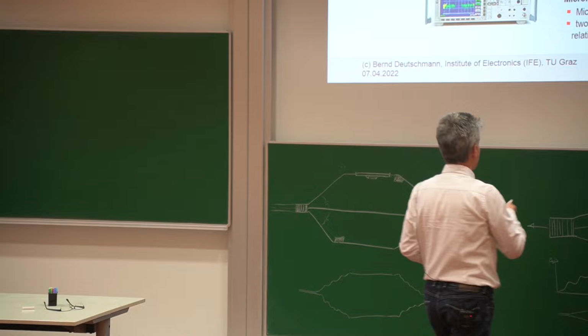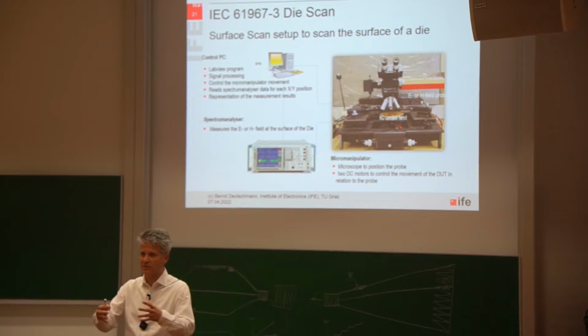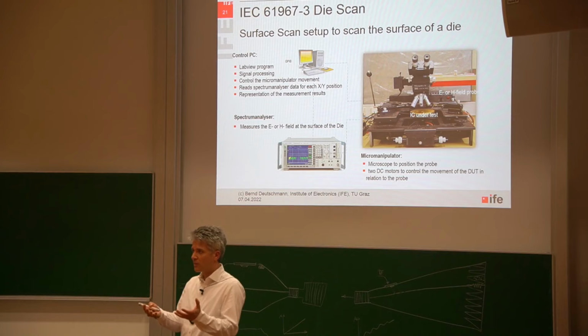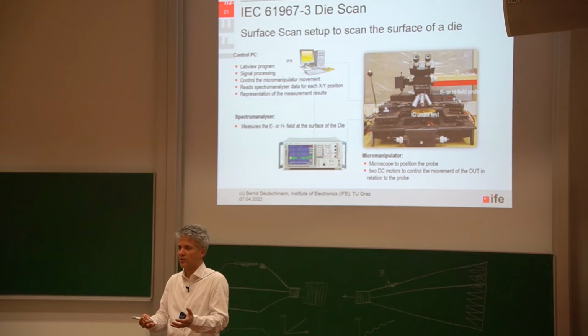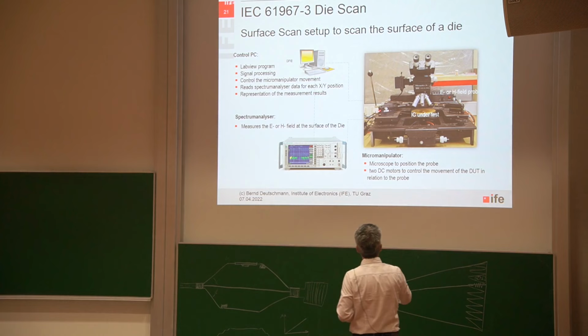micromanipulator, so this thing here. It's basically a microscope. And usually it's used to characterize microchips on the wafer level. So you can place a wafer directly here on this chuck. So it's just a plate where the wafer is held on by a vacuum. And then with micromanipulators, so small needles, you can then probe metal parts on the wafer. So these are the probes, the probe holders, and there are then the needles. So here you can see one.